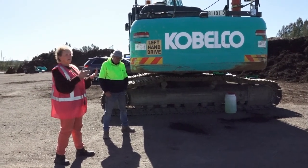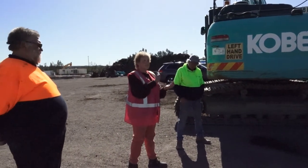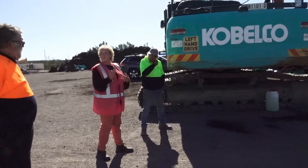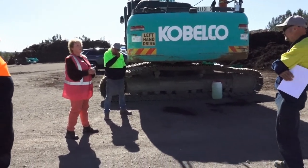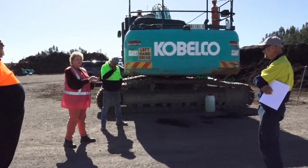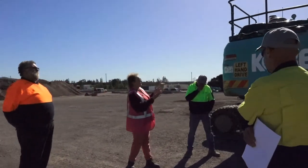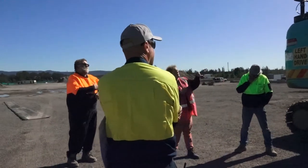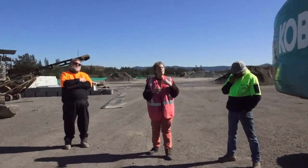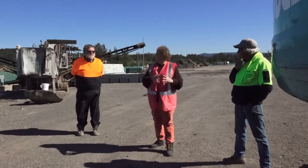Yeah, absolutely. I've got it on my car, and when I'm driving on the hydrogen, you learn to pull your foot back, because it's reaching its RPMs faster. The average truck driver tells us 3 to 5% torque improvement under load, and they like torque improvement under load. You get a feel for it reaching its RPMs faster, and you pull back from it. Essentially, it's very simple. It's just the hydrogen being fed through a control mechanism into the air intake. So now it runs on the two fuels. If it was to run out of hydrogen, it runs on its diesel automatically.